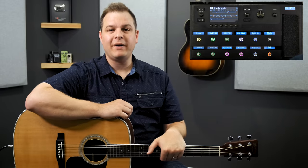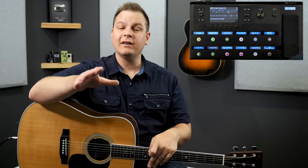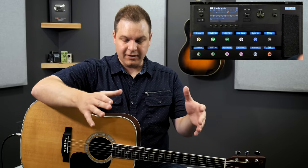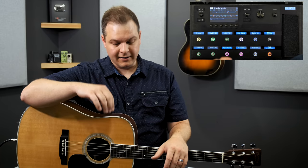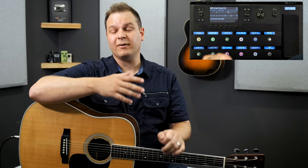This patch will process your guitar and your vocals completely separately. Before we get into this, I want to make a note: if you own a Helix LT, this patch is not going to work as designed — it works with the Helix floor model or the rack model out of the box. The reason is the floor model, the original Helix, includes a physical mic preamp that you can plug a microphone into, and the LT version doesn't.